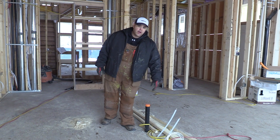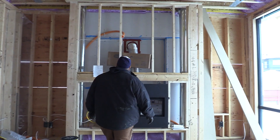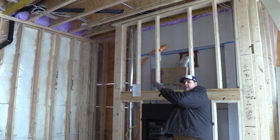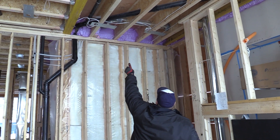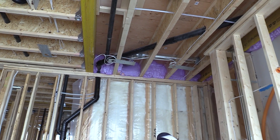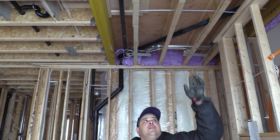Here we have the island sink — pretty standard, just a two-inch drain coming up with hot and cold water lines. The cold water line runs right back to the mechanical room, just in case they want to put a water softener in. Getting into the master bathroom: Karsten did his 45-degree through the joist — we have a video linked in the description on how to run your drainage at 45 degrees through joist spaces. The benefit is the fitting, the 3x2 Y he uses to pick up the bathtub — you get about twice as long a piece compared to going straight through, using fewer fittings and reducing chances of leaks.